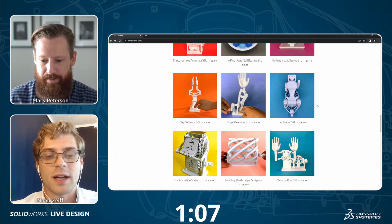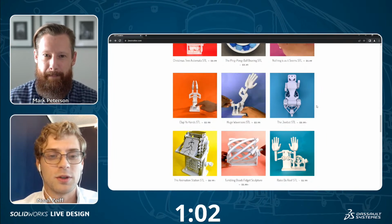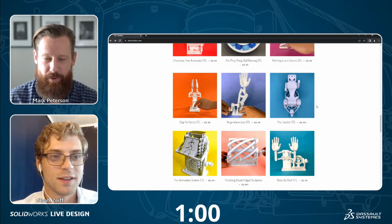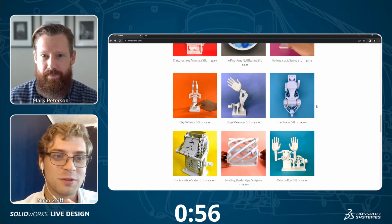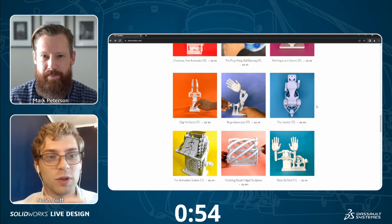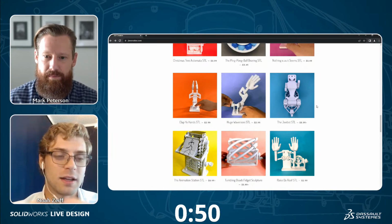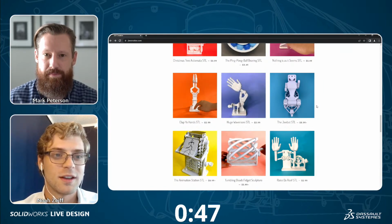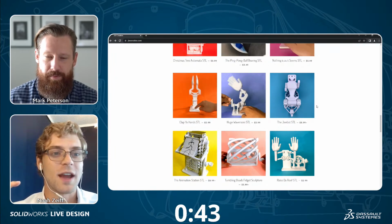I would say 0.2 out. And I would also say one of the amazing things about 3D printing is you can print in-place assemblies. People do that all the time, and you take it off the build plate and it automatically moves. But if you want some really tight fits, sometimes it's better to print the parts separately and assemble them afterwards, because then you're able to print some overlap, some interference in the gap.